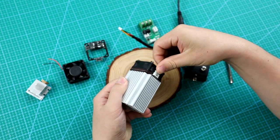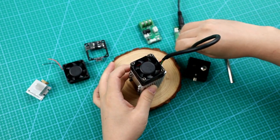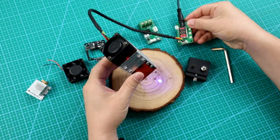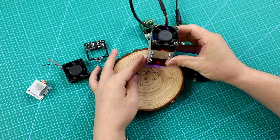For the basic information of this module, the input is around 30 to 40W, and the input interface is a 4-pin 2.0 connector, including the 12V, GND, TTL, and digital temperature signal lines.